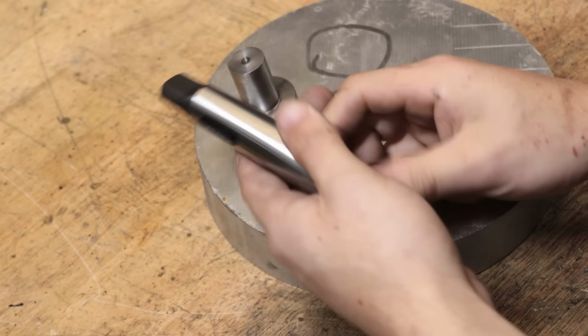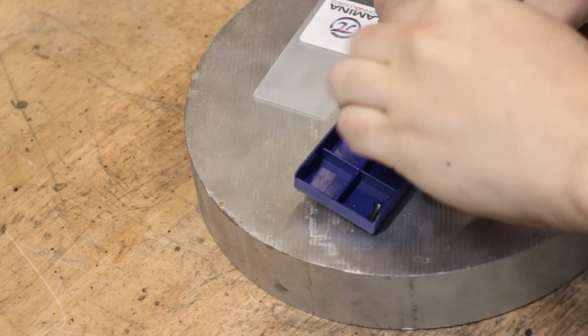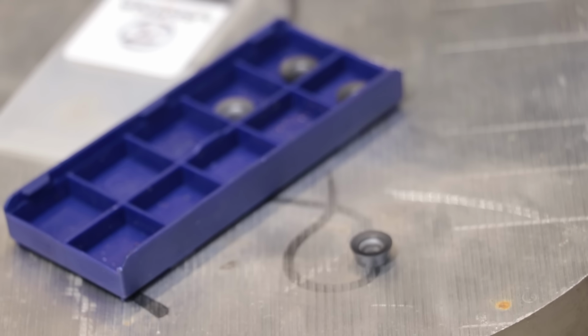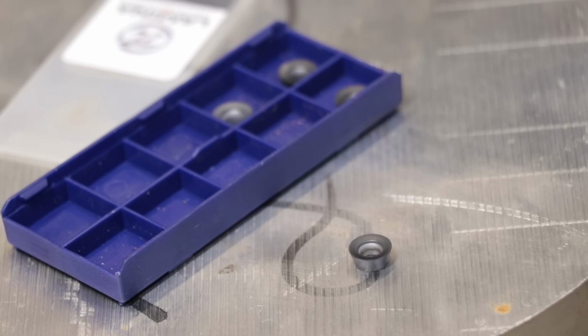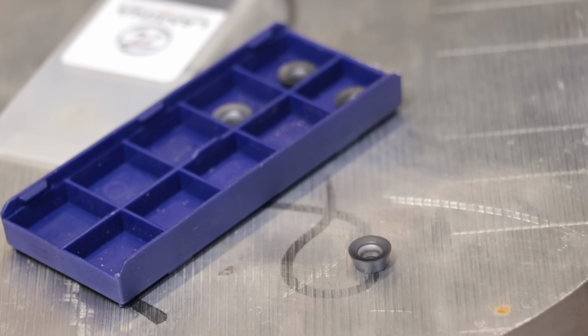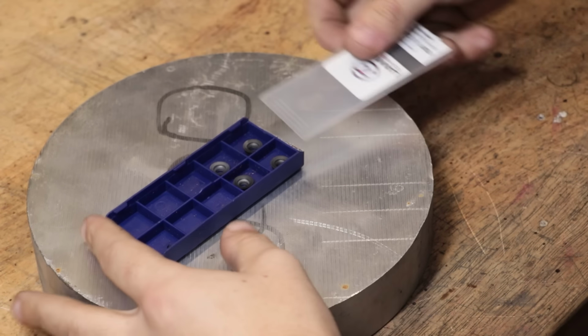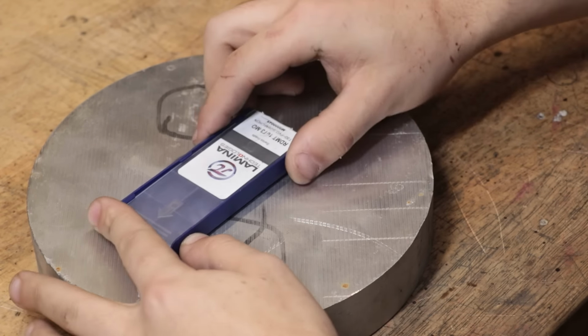And unlike Chris, who uses high-speed steel as his cutter, I'll be relying mostly on carbide button inserts to do most of my cutting. They're good inserts and they leave really great finishes in most metals, but I am going to have to make up a set of holders to hold them in the fly cutter. First things first though, we need to clean up that piece of aluminium, and already we're going to run into a bit of a problem.